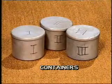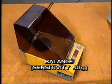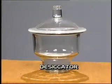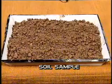We shall demonstrate the determination of water content of a given soil by oven drying method as per Indian Standard Code 2720 Part 2. The apparatus required for conducting this practical includes containers, balance with sensitivity to 0.01 gram, thermostatically controlled oven, desiccator with desiccating agent, and soil sample.